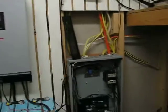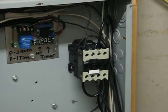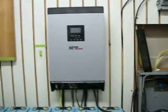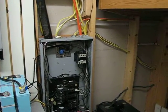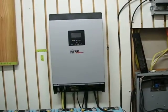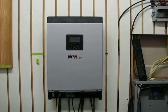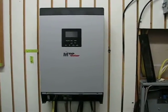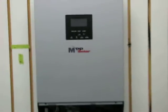I also added a contactor that, when the pip gets to back-to-grid voltage, it switches to the grid and disconnects the pip at the same time. It's working so well that I had no interruption with video or computer — I didn't even notice it, didn't even notice the lights flicker.